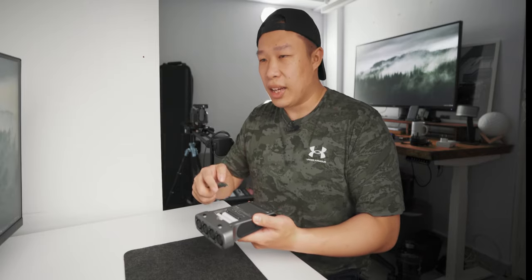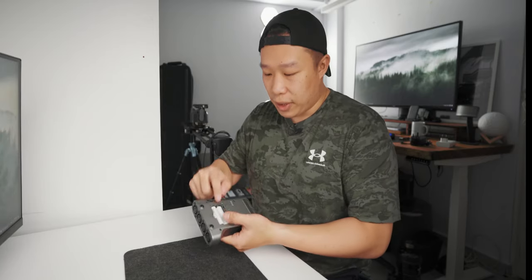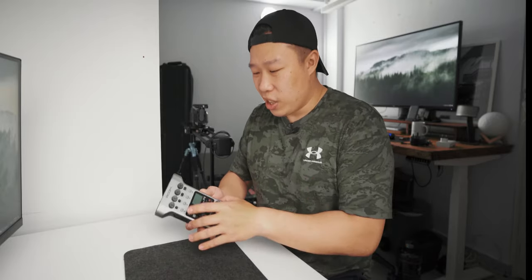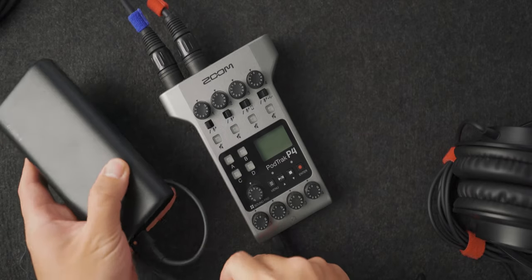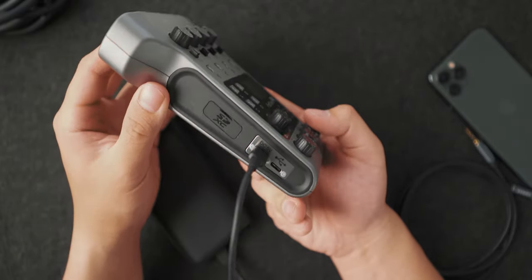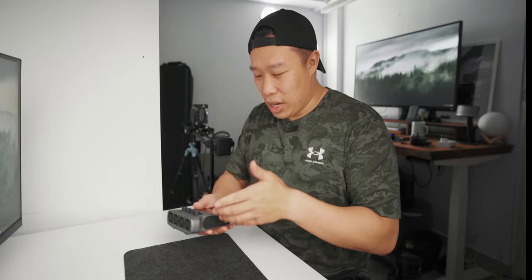You might be wondering how to power this. Since it's a portable device, it runs on AA batteries. AA batteries mean two things: they're easy to find if you run low, and you can use rechargeable ones for a long-lasting, swappable power source. That said, AA batteries aren't the most reliable, especially if you're using all four phantom power channels. So there's also an option to power it via a USB-C DC 5V input — very convenient because nowadays everybody has power banks. Just bring one big brick and you can power this much longer than AA batteries.